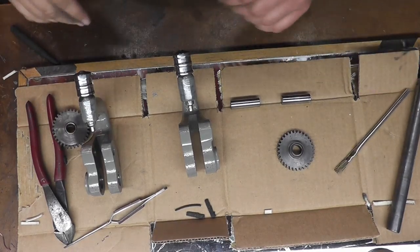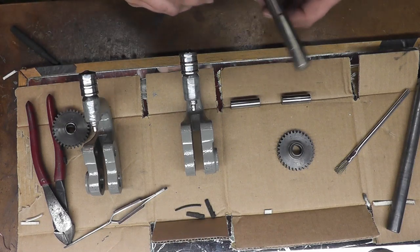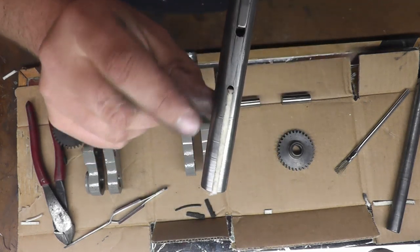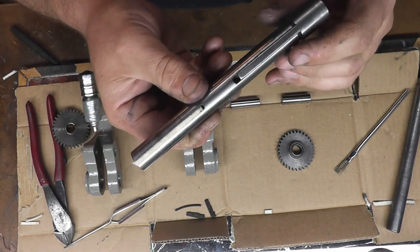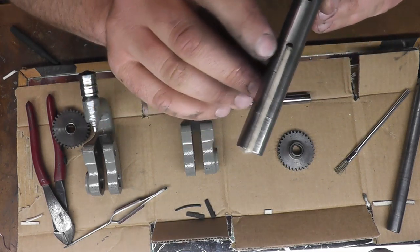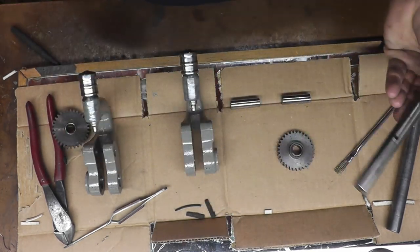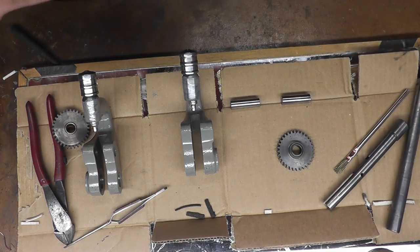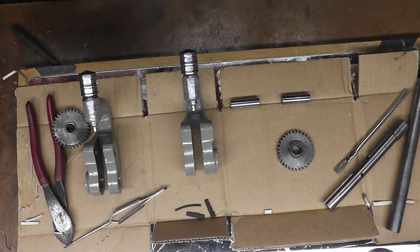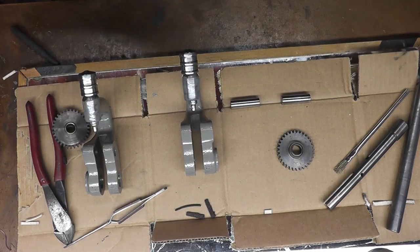Okay, now we're getting ready to put everything together, so I want to put the gears and the handles first. Now all the shafts that we have, every part that there's a slot in them, a felt goes in there. So this is the shaft that the tree goes on. Ooh, excuse me. There's a felt in there. Also the shaft that the screw gear goes on, which I just had in my hand, which ran away from me. There's a felt in here and a felt on the end.